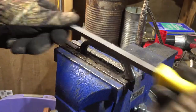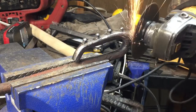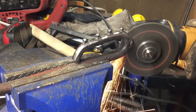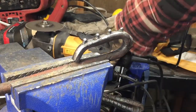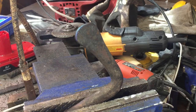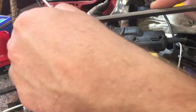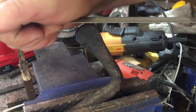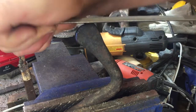After all of that filing and grinding, the metal had kind of shined up. In a way that's a cool look, but I was going for something a little more grungy. So I brought it in and threw it in the oven at 500 degrees for a good hour. That brought the color back to about an almost purple, deep blue — almost like a gun blue type of color. That also had the added benefit that if there was any overhardening in any part of it, a good hot temper like that should bring it back to a real flexible, tough metal.